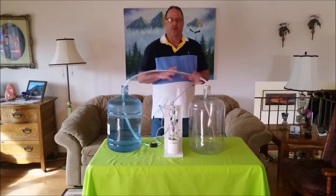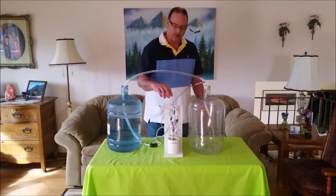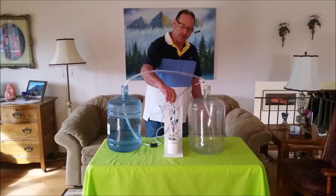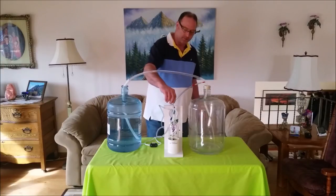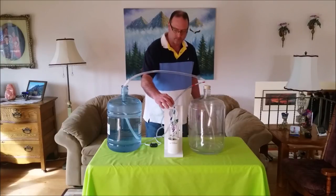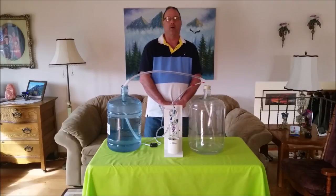Every system is a little bit different. So now I'm going to turn it down just a little bit more — make it only two and a half turns instead of three full turns, which is now going to increase the flow. So now we're going to be flowing at approximately one gallon per minute.